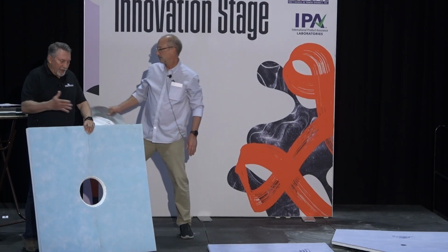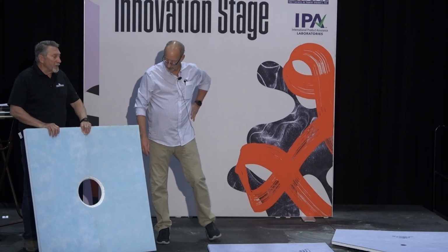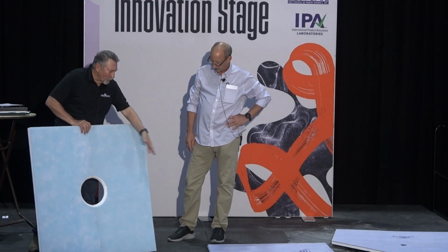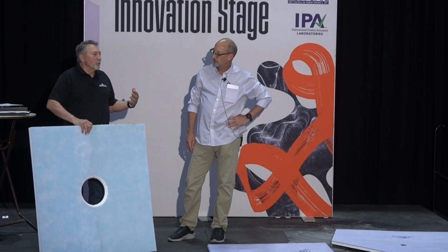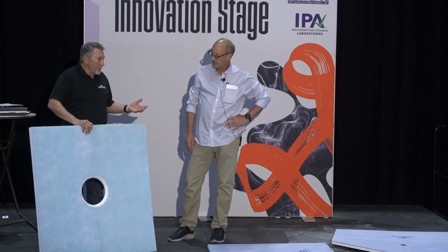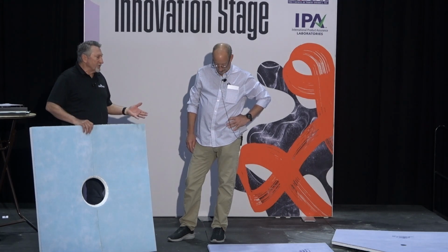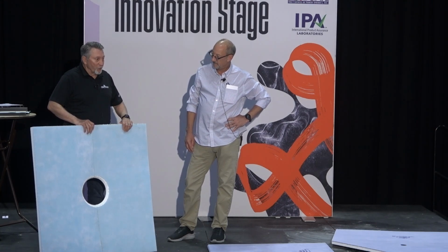Again, any sizes that you need, and the drain hole wherever you need it. It's got to be at least 10 inches off the wall. Okay? We also can do these in an ADA compliant version, where 1/4 inch per foot is the max slope that you can go from one side. We've done quite a few of those in commercial, even in this version.